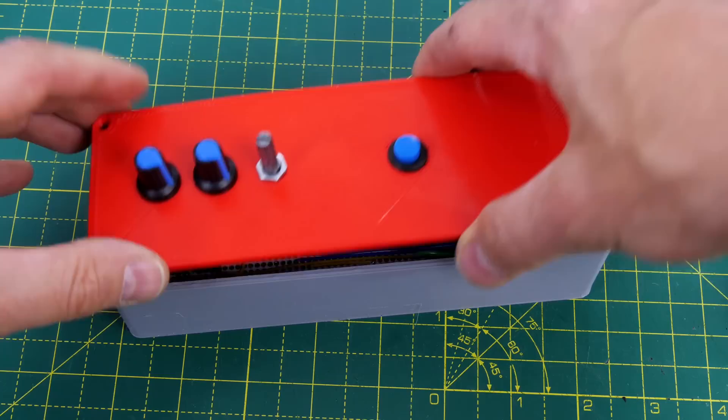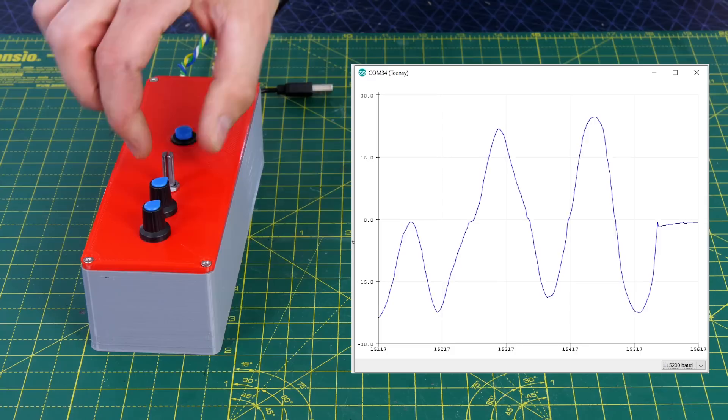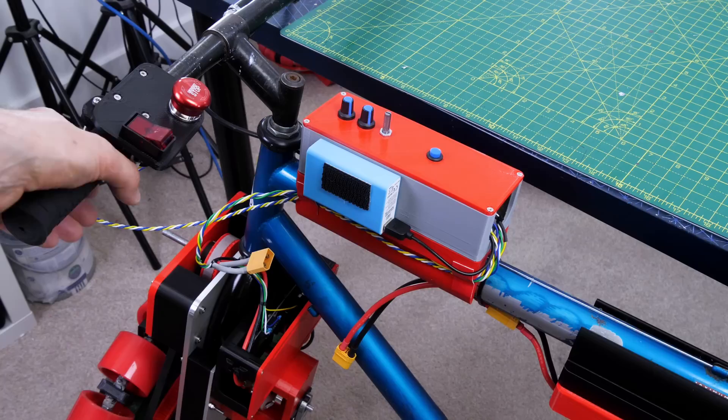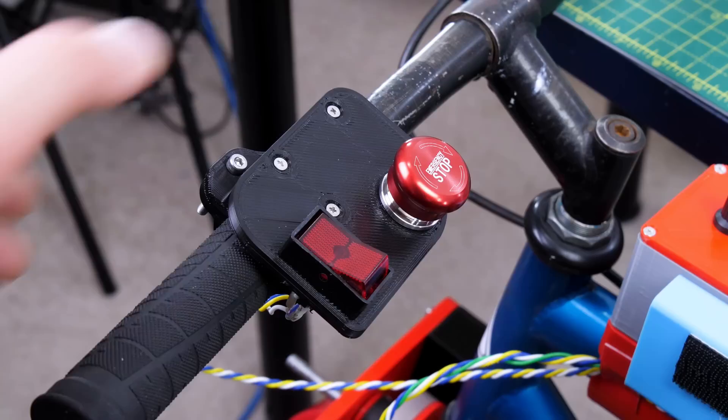As I tilt the box now we can measure the angle that we are actually going to balance at and this is going to work a bit like a balancing robot. You can see the swing there positive and negative around the zero point and I've also got a little trim pot so I can get the zero balancing point perfect. The control electronics are mounted on the top of the crossbar so I can easily get to the controls, and there's a separate USB boost bank battery so I've got a separate clean power supply to power the electronics.